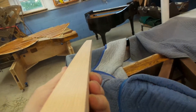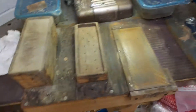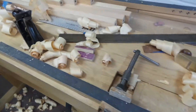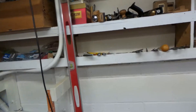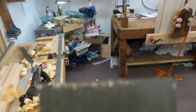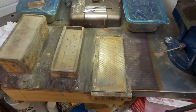I'll do a rant about sharpening. I hear a lot of people talking about polishing their edges on their planes to make them super smooth, microscopically smooth, which I don't care about at all. Originally, this is called a toothing plane — it actually has little grooves in it. It puts little imperfections in the wood, and originally these joints were toothed. So you don't care about how perfectly smooth they are — you care about that if you're doing cabinet making where the face is going to be showing.